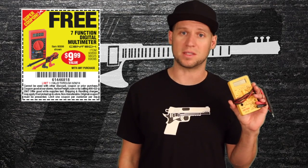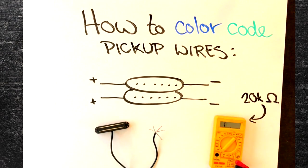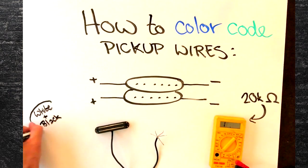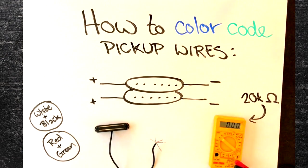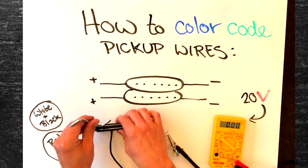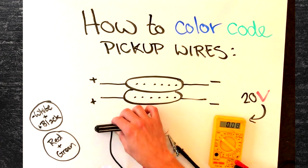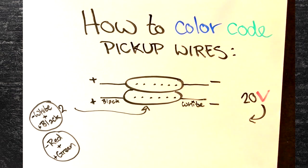This way requires a voltmeter. You can get one for cheap or free from Harbor Freight, especially if you subscribe to their coupons in the mail. You're also going to need a screwdriver. Set your voltmeter to read in the 20 kilo-ohms range. Pick any two pickup wires and touch your voltmeter wires to them. If you get a resistance reading, then both wires are connected to the same coil. If you don't get a reading, grab another wire and try again until you do. Once you have two wires that give you a reading, you will also get a reading if you connect the other two wires. Now to determine which wires belong to which coil, change your voltmeter to the 20-volt setting. With one pair connected, tap on one of the coil's pickup poles with your screwdriver. If it changes the reading, then those wires belong to that coil. You'll also notice that the reading either went positive first then negative when you disconnected it, or vice versa. If you get a positive reading first, then whichever wire is connected to the positive lead of the voltmeter is the start or positive wire of that coil. If it went negative first, then the wire connected to the negative lead of your voltmeter is the start for that coil.